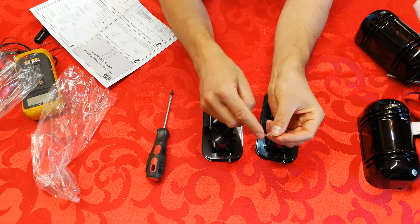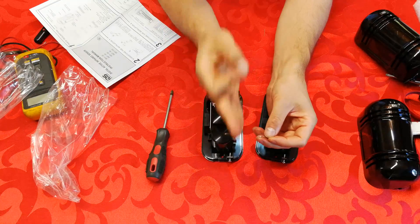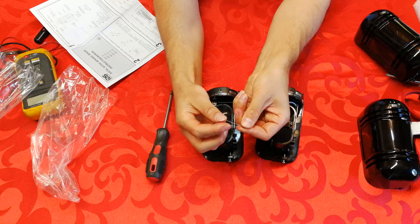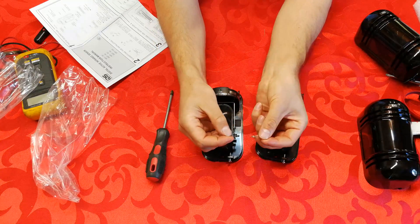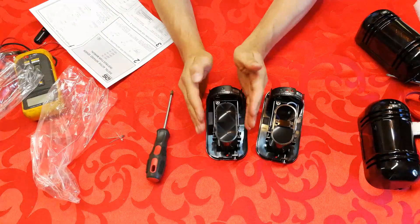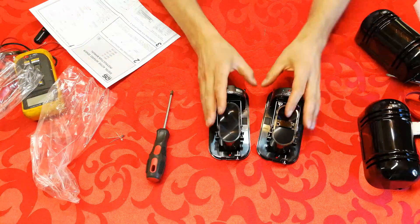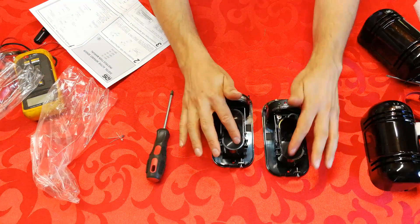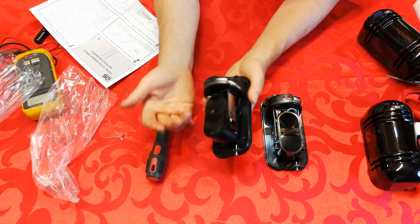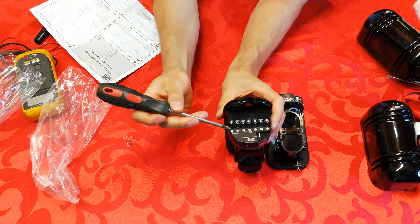The other is a detector. It emits the infrared signal and the other detects it. When that signal is broken, the volt drop across the terminals on the receiver changes — that's what initiates the trip. This is a lens; the point is it focuses the infrared so it doesn't spread over your whole garden or factory. These are focusing devices, and inside are the photo diodes.